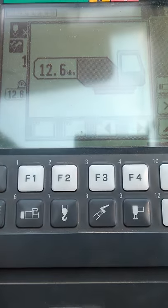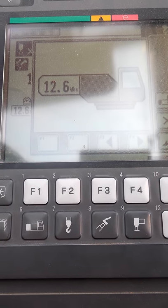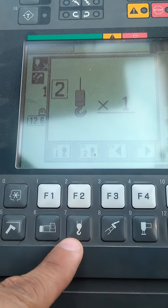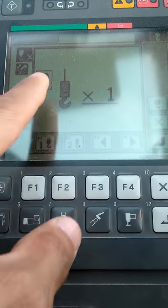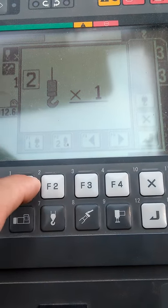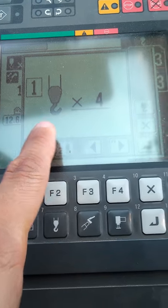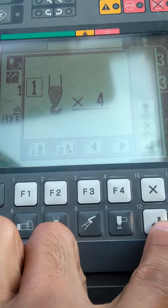This button is to set up your counterweight. It's adjustable — you can change it out to a heavier or lighter one. This other button is for your line reading. We're on the whip line, which is the second drum — it's only good for one line. If you want to switch to the main line, you go to the first drum. Right now we have it set up for four parts of line, though you can change that more or less.